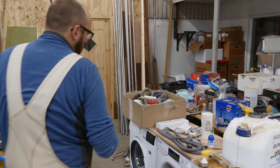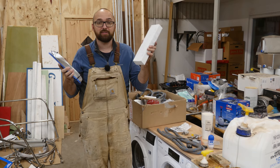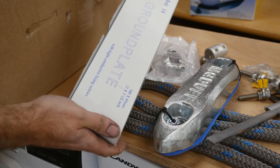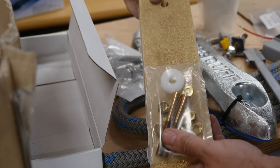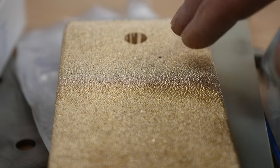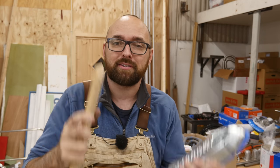While I'm waiting for that thickened epoxy to cure, let's move on to something completely different: zinc anodes and sintered bronze plates. This four kilogram zinc anode is going to get through-bolted to the hull, and this ground plate is also going to get through-bolted to the hull. The ground plate — which is just a piece of sintered bronze — is made up of a bunch of tiny little bronze balls. Because of the gaps in between all of those little bronze balls, this thing has a ginormous surface area. Both of these are kind of going to be a part of the electrical system, but I'll come back to that in much more detail later this winter when I install the generator and wire up all of the AC and DC aboard the boat.